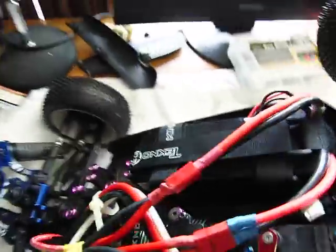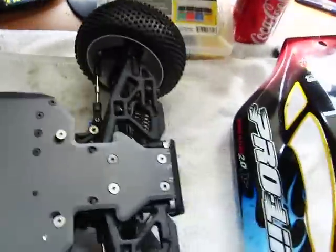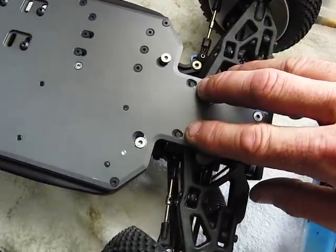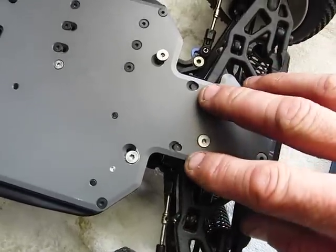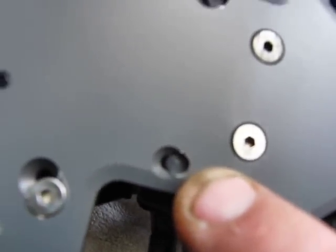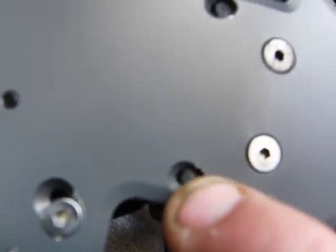But the bottom — I'll show you where in the front is where you need to make the modifications. These four holes line up perfectly. But the problem is that you have these two little dimples that stick out and need a hole so that everything lines up flush on the other side. So you have to slightly drill out, make these a little bit longer, do it there and do it there, because as you can see they don't line up perfectly with the stock hole.